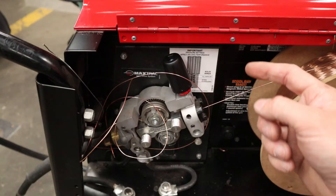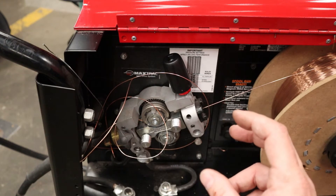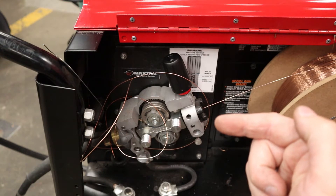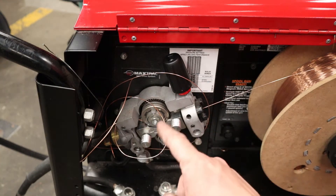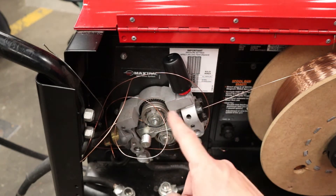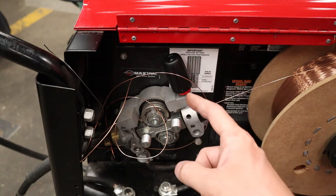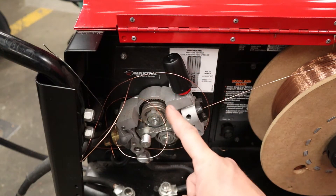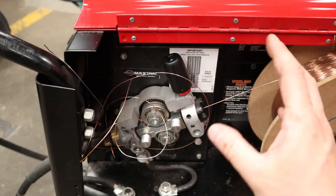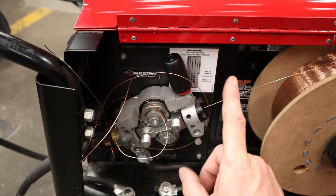The second thing is your tension on the feed mechanism is set up incorrectly. If the tension is set properly, it will slip on the wire slightly when the wire is jammed — damaging it a little, but it slips. If the tension is too tight, instead of slipping it grabs the wire and kicks it out, giving you a bird's nest. I've made a video on how to set up your MIG welder including a tip on setting your tensioner properly, so I'll put a link above.